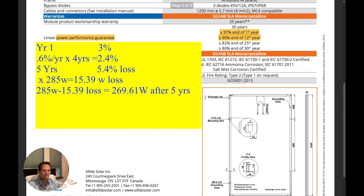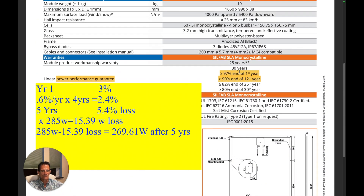This particular manufacturer has a 30-year warranty on their power output. Just like everything else, solar panels wear out over time — they gradually produce less electricity, or we call it degradation. In the case of Silfab, they're doing 80% by the 30th year, so their warranty is better than most companies. There are companies that even have better warranties than this. Again, it's a midline panel.